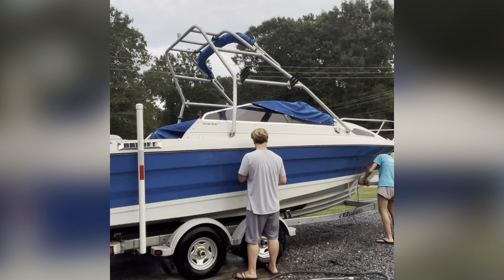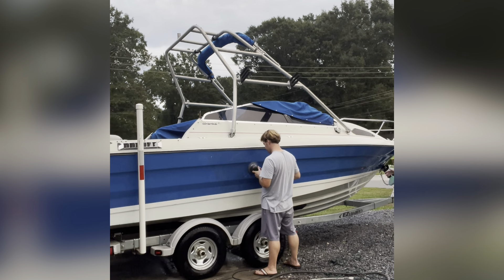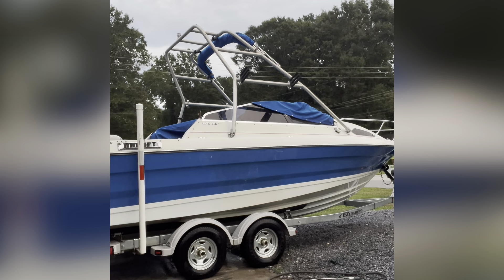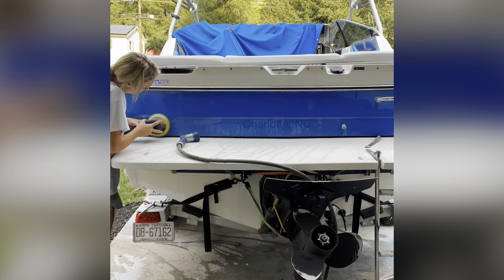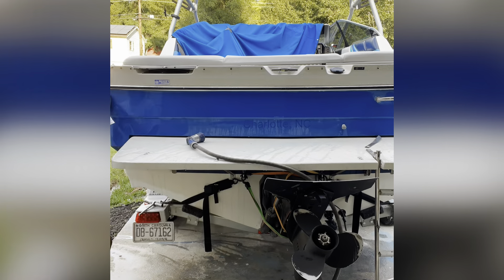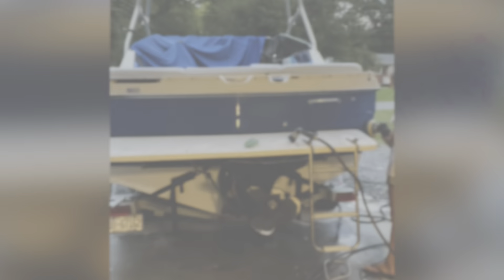As you can see on the left side of the blue where Barry is standing, somebody has previously wet sanded this. I'm thinking they went with about 400 grit because they went way too far in, to where it actually changed the blue that's there. Since this boat has been worked on before, we did use caution and didn't go too crazy on it — I didn't want to do any further damage. On this back section we are wet sanding again: 600, 1,000, 3,000, on that bottom right above the white deck.